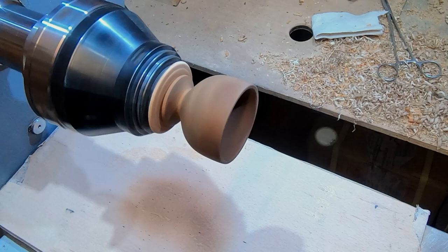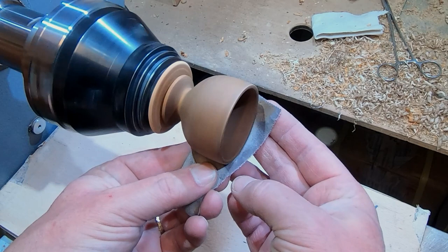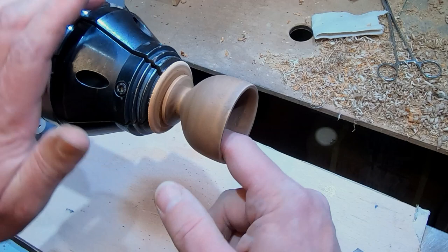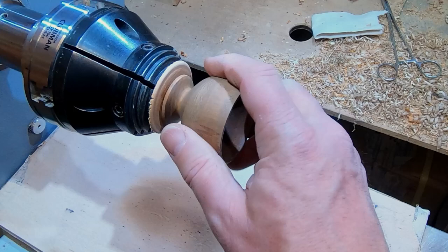So that should be plenty enough. So you can see how it brings the brown off there on the paper. I mean, that is super smooth. So that's now knocked all the grain back, and it's not really taken much out of the colour, it's just made it a little bit paler. And I will respray that again now and let that dry, probably sand it back, and probably then give it a third coat.